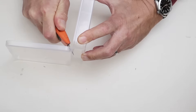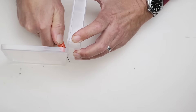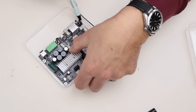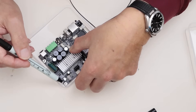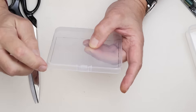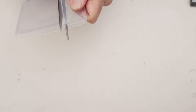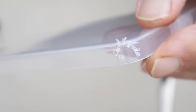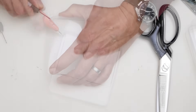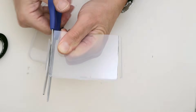This lid is very easy to cut off using a knife, but still be careful. These plastic boxes are very cheap and come in packs of four, so if you mess up you can just call it practice. Next I'm going to use the lid of the box and cut it so it's just a little bit larger than the board itself. I mark out where the board fits on this lid and cut all of this away. It's easy to cut the flat portions with scissors, but if you try to cut the corners with scissors you're going to crack the box. So we need to cut notches to allow the scissors to pass through. We don't want to crack the plastic while cutting the notches, so we make some perforations around where we want to cut them using the pin vise. After the perforations it's easy to cut the notches out with a knife, allowing the scissors to pass through so we can cut the lid without cracking the plastic.